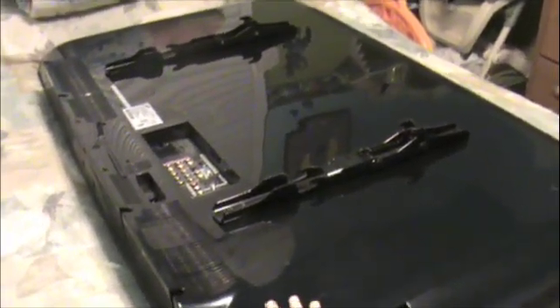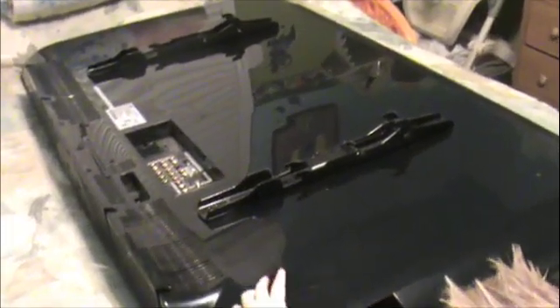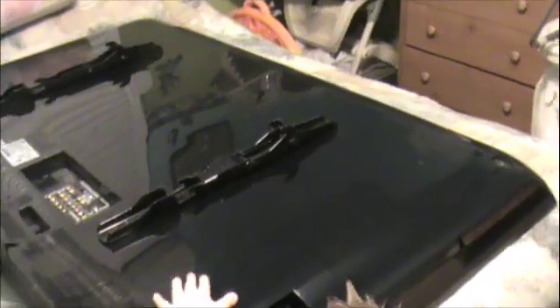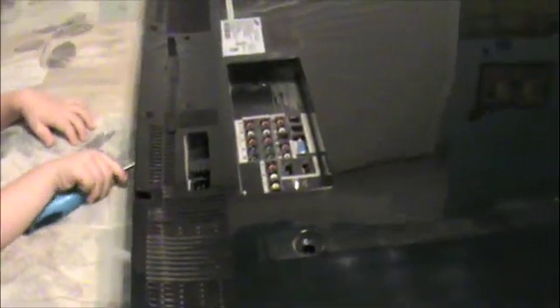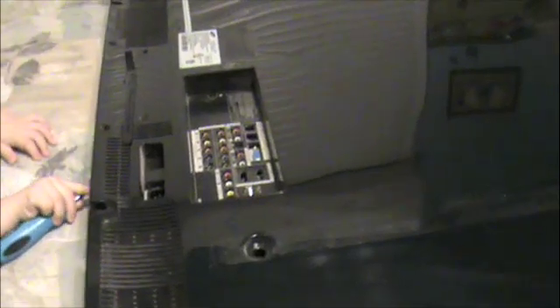The problem on this TV — what I suspect — is that the bypass capacitors in the power supply are electrolytic and they've probably given out. It's a pretty common problem with electrolytic caps, so we'll see when we get it further apart. We've removed the four screws holding the mounting brackets, and there are 15 screws around the perimeter of the screen, plus one sneaky screw down inside the interconnect box.